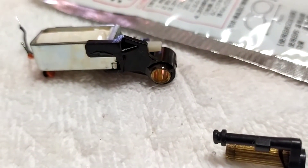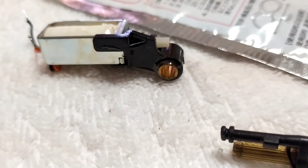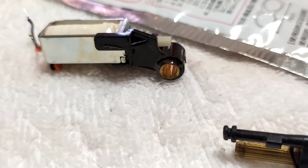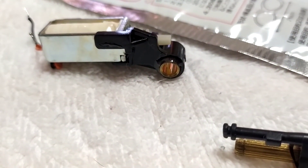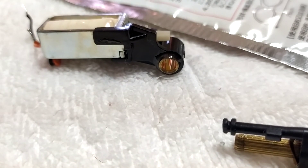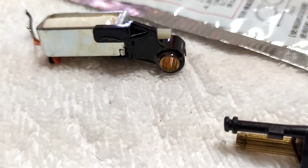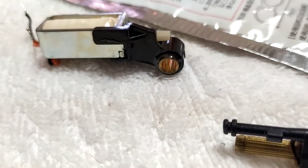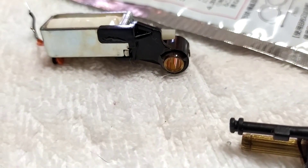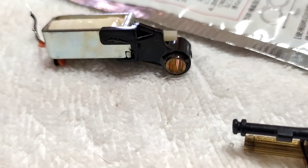It's glued in now. The solution I went for was epoxy — I'm not sure why I didn't think of that before. Epoxy sticks well to metals, forms to the shape of any irregularities, and makes a nice snug fit, so it's unlikely to move around. It's a 10-minute epoxy, but I'm giving it extra time since it's pretty cold here. I'll probably sit it in front of the heater or on top of the oven just to get a little extra warmth and help cure it.